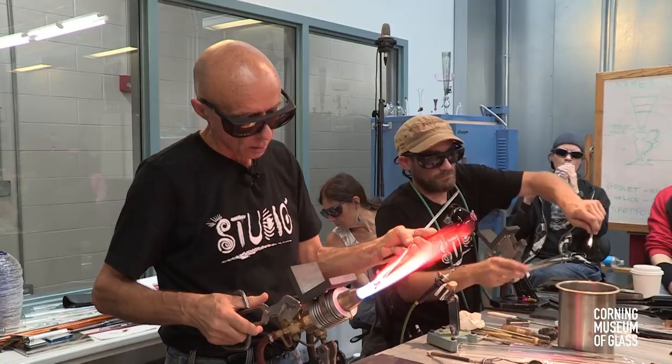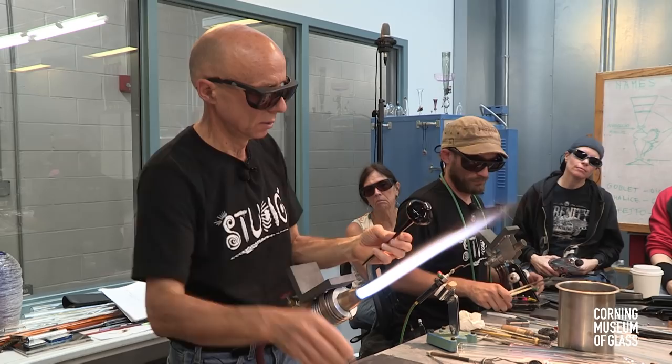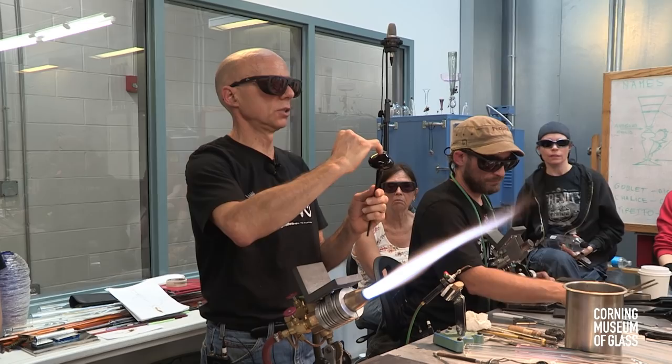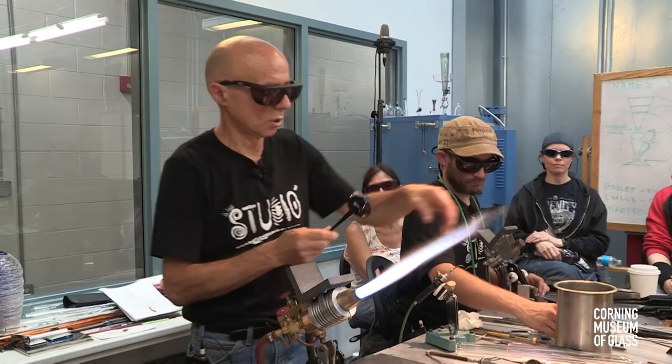What I'm gonna do is put it on the grabber, but not right now. I'm gonna take this and save it inside the kiln. Why? Because if I put it here, this part goes down, there is the joint, and if I go back and try to reheat everything, it's gonna crack. I would have to preheat it very slowly, just with gas, and it would take me like 10 minutes wasted. So I'm gonna park it in here while I show you another thing.